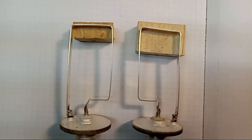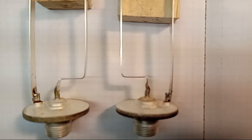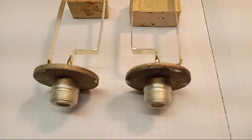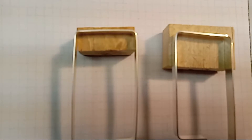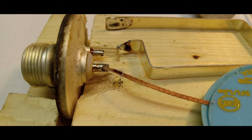The original coupling loop assemblies were disassembled, modified, and reused. The end connector was press-fit and soldered into the brass disc and then silver plated. I did not want to have to remove these. The flat silver plated coupling loop was removable by melting the solder, and the connector holes were then cleaned of any remaining solder.